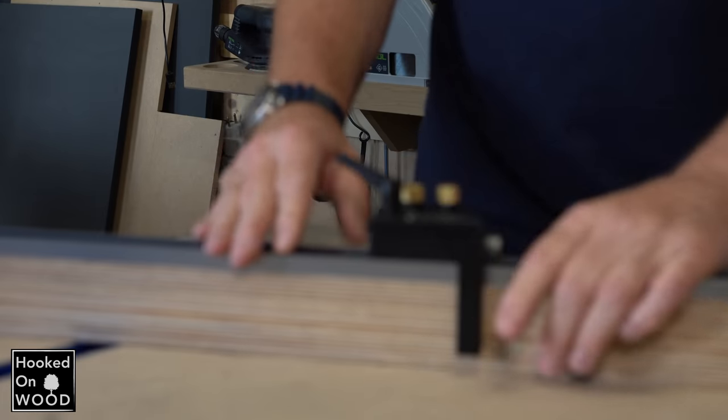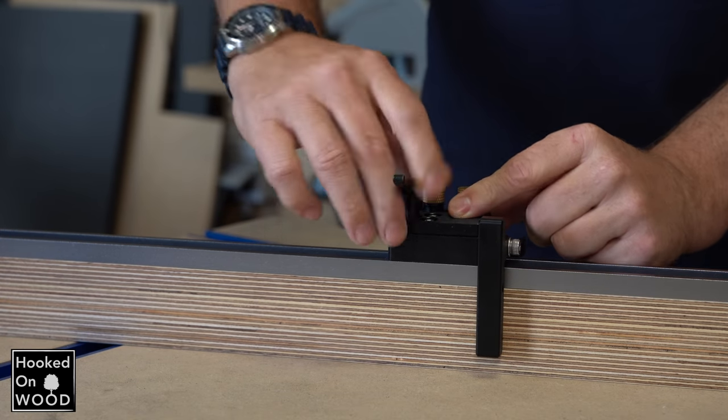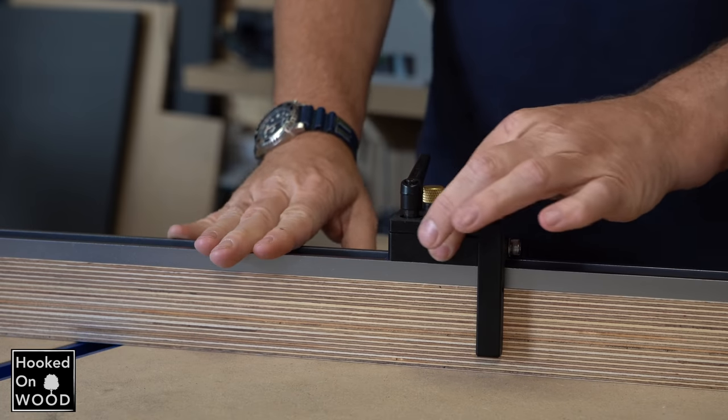The dark grey T-track is slightly different in measurement, and therefore it does not work with the aluminum sliding nuts — you cannot tighten them down. It works on these blue sliders, but you cannot buy those separately. So this is a shame, and because of this I would not advise this T-track, or you should make the slider nut a bit thinner on the above side. The rest of the colors I tested work perfectly.